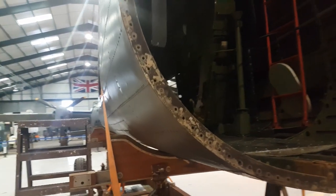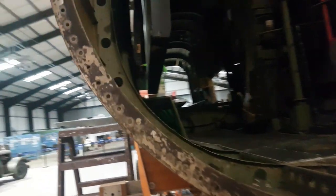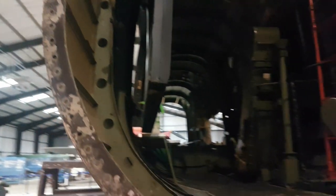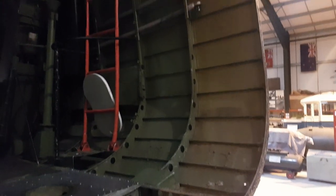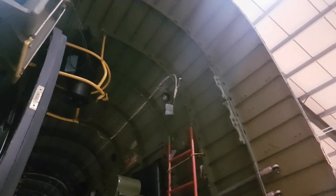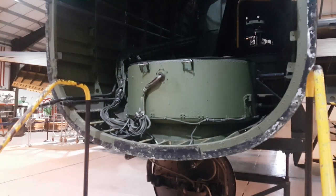So a quick look around the fuselage as it is now, separated. This is the transportation joint — there are two faces, the rear face and the front face. One of our concerns is whether there will be any corrosion between the two faces. On first inspection the joint looks quite good; it was painted black in the factory when it was produced and hopefully that paint has preserved the structure and reduced any possible corrosion. You can see all the holes that run around the face, showing the sheer number of nuts and bolts that join the two sections, and all the stringers that terminate at the transport joint — these all have small castings at the end of the stringer which will also have to be inspected.